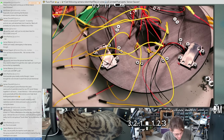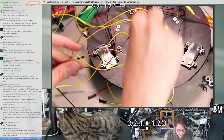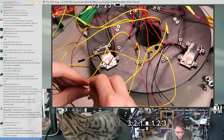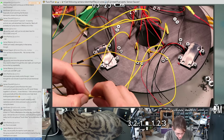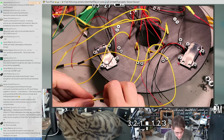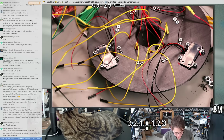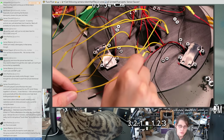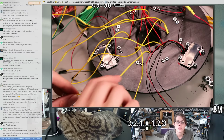The wire on the breadboard jumpers I used for the microcontroller end of this is just super thin, so I'm a little worried that that's going to be the weak link here. Some of these joints I managed to fold it over so that there's a bit of a strain relief, but some of them there's just no strain relief really, so this might be a weak point.